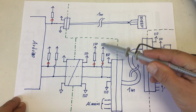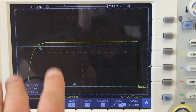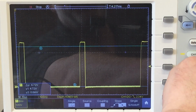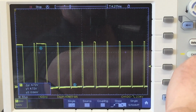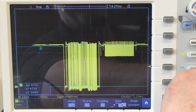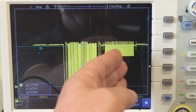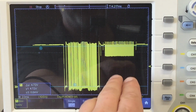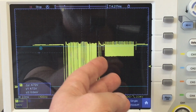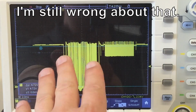And now at the pull-up resistor of the other one-wire channel. The other isolated channel is looking good too, and as I did before, I'm looking at one of the very short spikes here. And, well, we have the grizzle here. That's when the DS18B20 does its temperature conversion. And as I said, normally you see that when you run them on parasitic power, not on direct power.